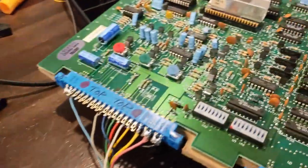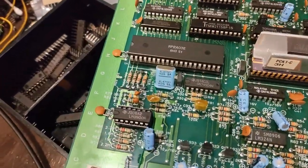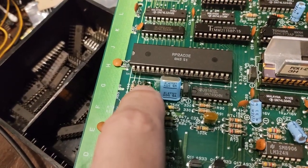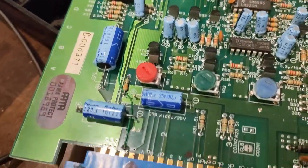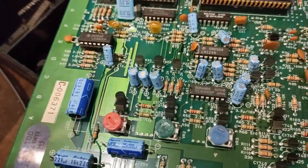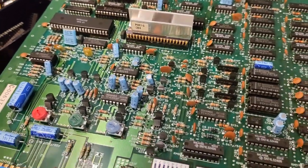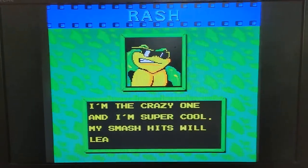But yeah, if anyone out there is having trouble with sound and not getting any sound out, what I would recommend is taking a look at these 2 resistors here. And I think you can probably take it from the back, or you can take it from up front here. But maybe just running a wire all the way down here, and then just severing the trace. I just made a small cut down here to avoid anything else that's possibly causing that humming and staticky sound. Just going straight to the source, because that will give you crystal clear sound, and you won't have to worry about it.